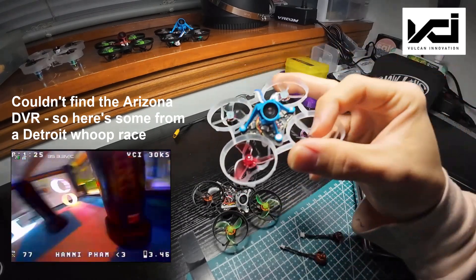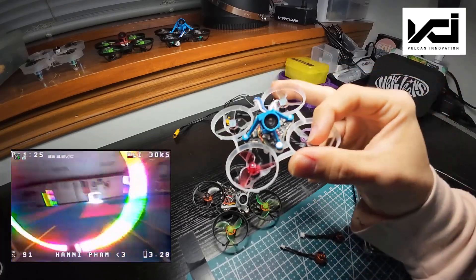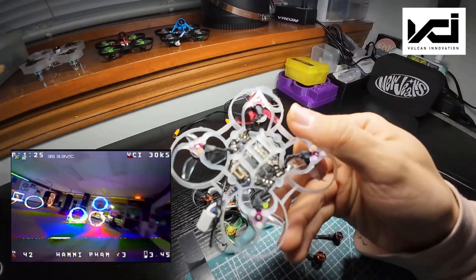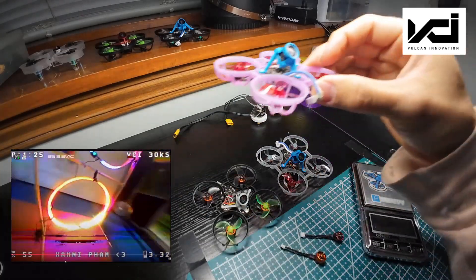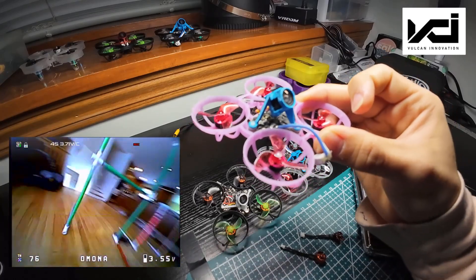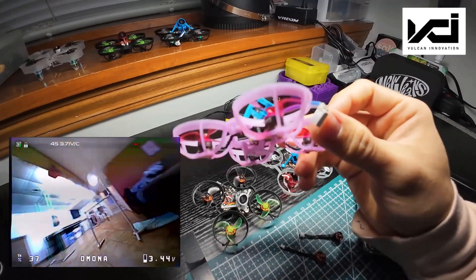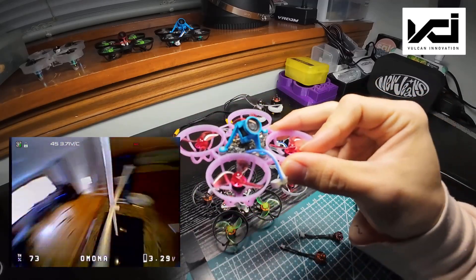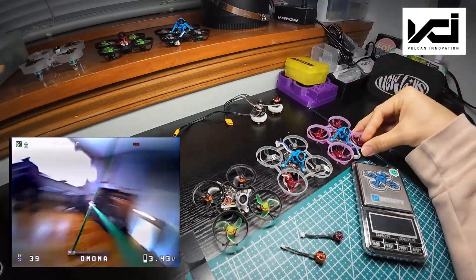On the second prototype, the bell was redesigned to shave some weight, the KV was increased to 30K, and the winding method was changed from Y to delta. I used these motors in some of my December training footage with AK in Arizona. Moving on to the third and final prototype — I've been testing this since last month. We have some material changes to increase efficiency. We returned to the Y winding style and the KV is still 30K. This was the motor I used in my most recent DVR in the Syracuse Airbnb, and it's more efficient than the previous prototype with much better low-end torque.